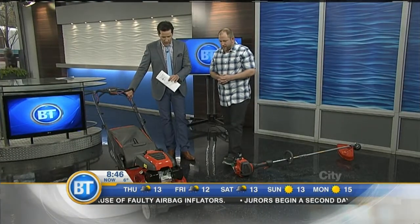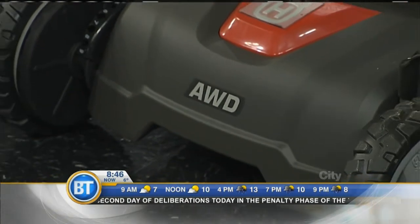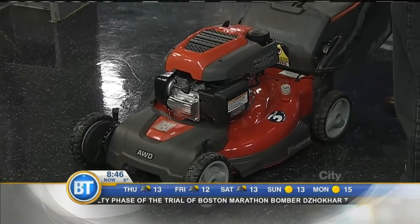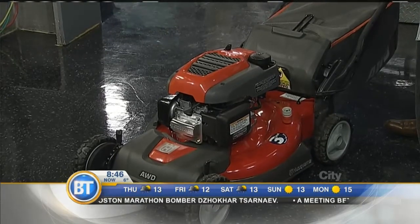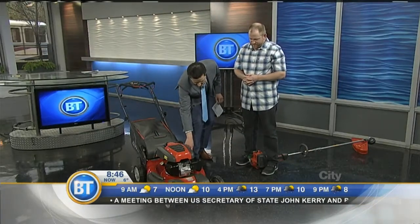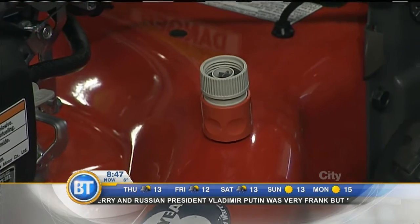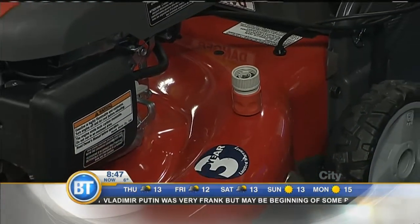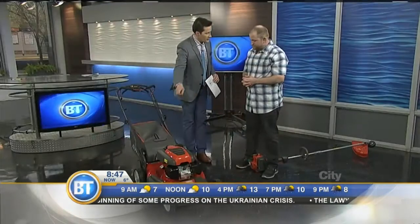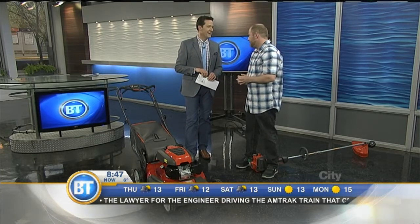What are the features on this lawnmower? Husqvarna has been the first to come out with an all-wheel drive slash four-wheel drive lawnmower, so if you have uneven terrain the front and rear wheels work together to move it for you. They also incorporate a Honda engine with an auto choke, so there's no more priming or choking — you can't flood it. There's also a garden hose attachment here — it's a deck washout port. After you finish mowing, hook up your garden hose to it and run it for about five minutes over a lawn area. It cleans the underside of the lawnmower deck very well if you do it every time.